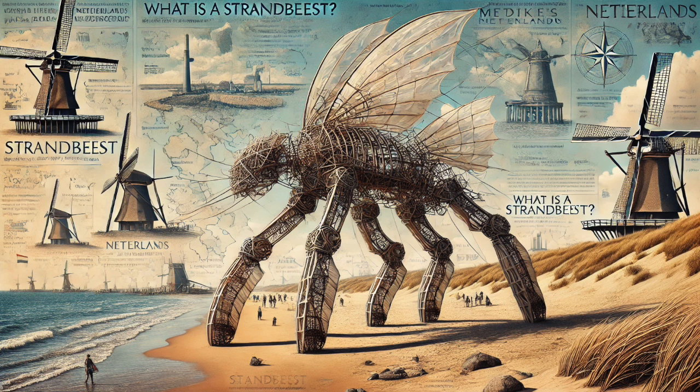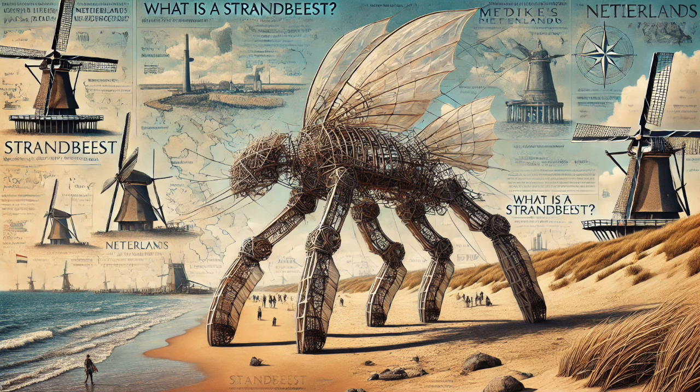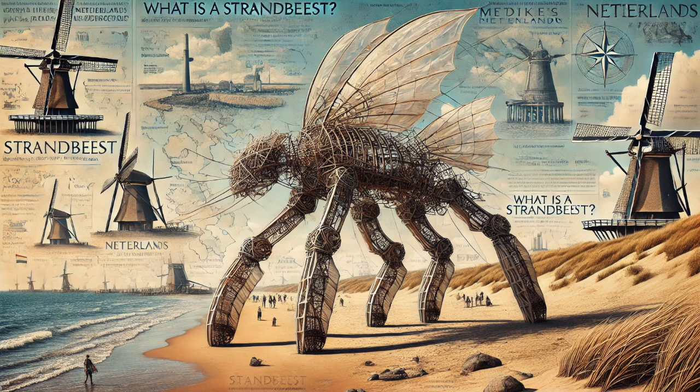These holy numbers are actually specific ratios — ratios between the lengths of the rods that make up the Strandbeest's legs. It's these ratios that give the legs that smooth, natural walking motion. Think of it as a series of interconnected levers, each precisely calibrated to create a seamless flow of movement. Janssen didn't discover these ratios through complex equations — it was years of trial and error, building and testing countless prototypes, this hands-on relentless experimentation. It wasn't a fancy computer program. Pure observation, intuition, and a willingness to learn from every failure.